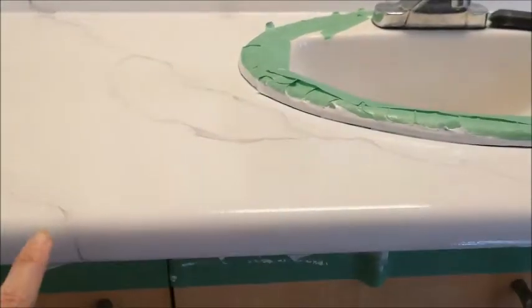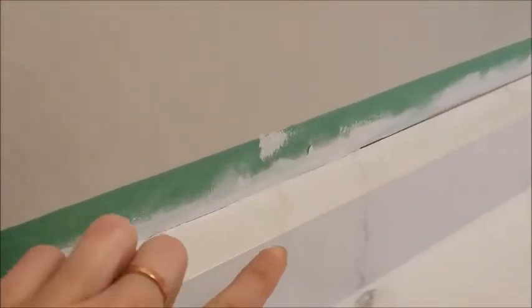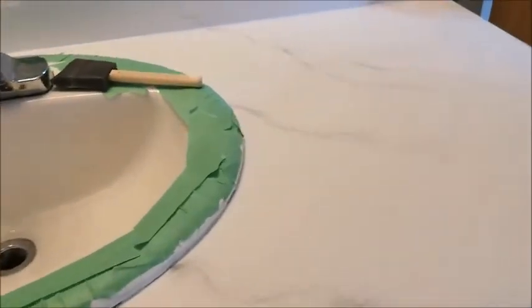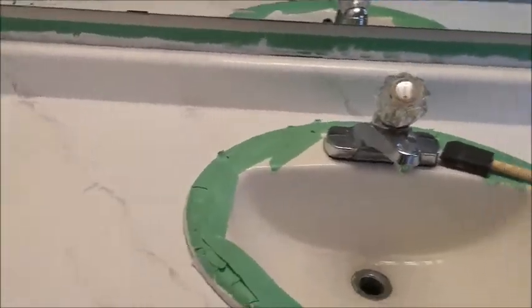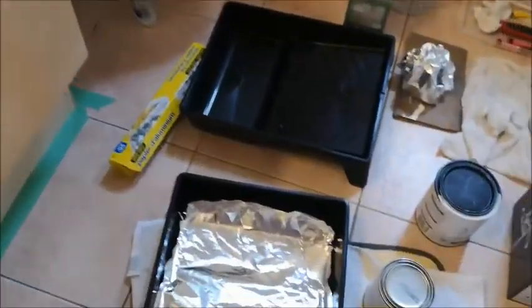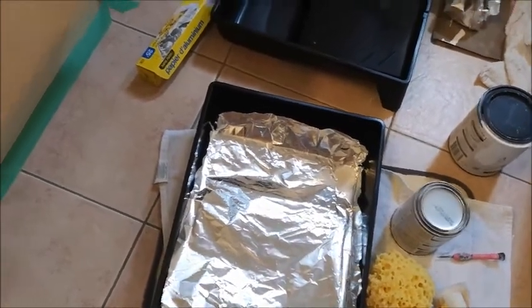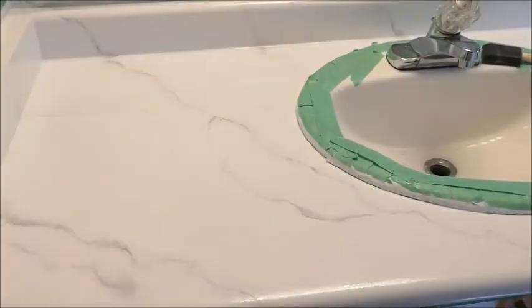I'm really pleased with it — here's a little overview. It was kind of hard to do the round edge of the countertop because in the company's videos their edges were all square, and they didn't show how to do rounded edges. I also have a rounded edge at the back which wasn't covered on the website. For the clear top coat, I recommend putting tinfoil in your paint tray so you can reuse the tray for something else. Now that this is done, I'm going to end up painting the cabinets white as well.